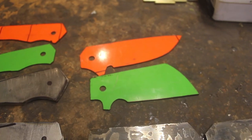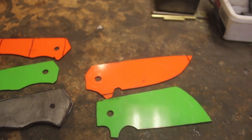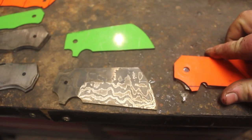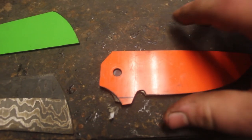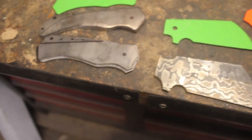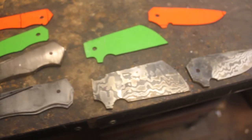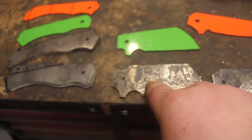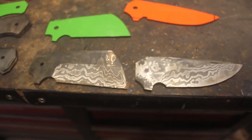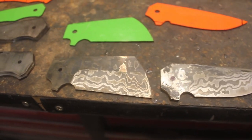And these, even though they're silly and not exactly, you know, precision technology, they have been proving themselves to be invaluable. I can tell where I want to put my pivot. So, this is going to be quite a bit of drilling, as they've been annealed, but the cores in these are 3V, so they will still be a bit tough. I'm going to do a little bit of punching to make sure I get all the holes centered.